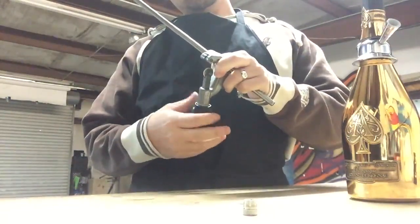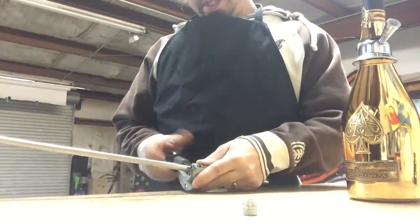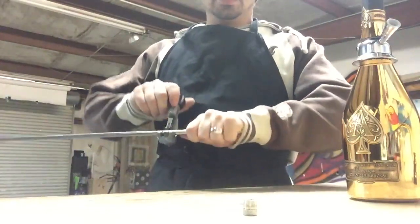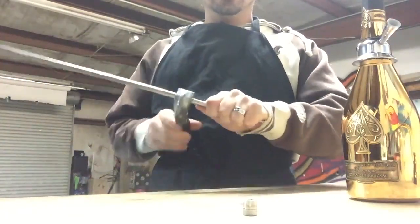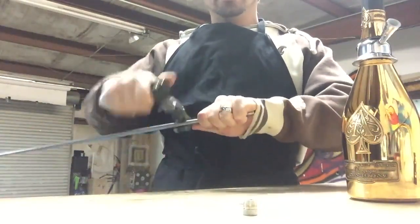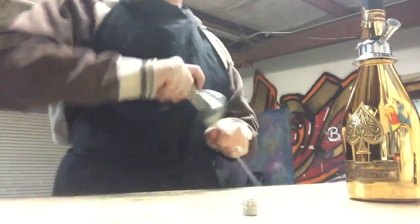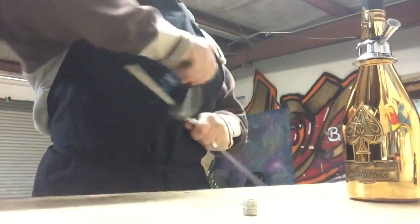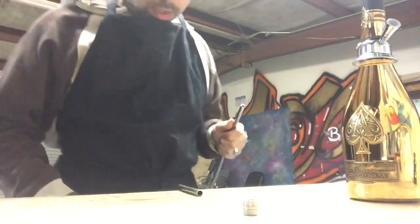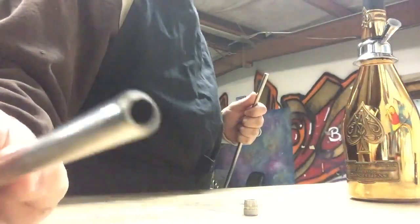The way this works is pretty simple: you make a gap by turning the screw handle, lay it right where you want it, line it up, snug it, then start going around the pipe, tighten it more, go around the pipe, tighten it a bit more. Keep going around and tightening until you start to feel it free up — and it cuts right on. Perfect cut. It even rounds it by the nature of the way it's being cut.